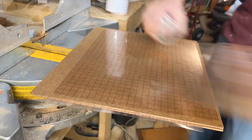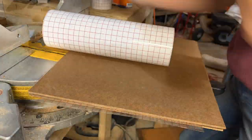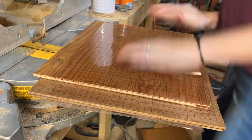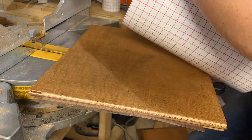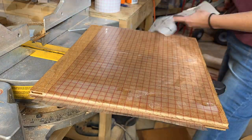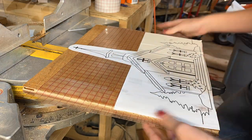I've got these four layers and I'm going to attach them all by applying transfer tape to the tops and bottoms of each layer and applying some spray adhesive to stick them together. You can also do this with painter's tape or contact paper, but you want to protect the wood from the glue. Now that they're stacked, I'm placing my drawing right on the top.